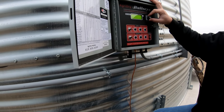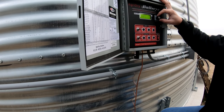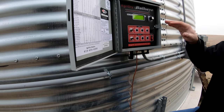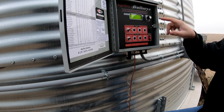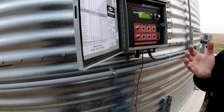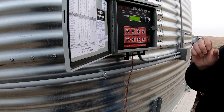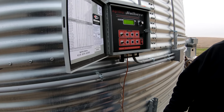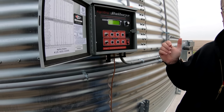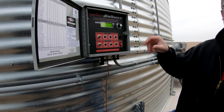You're pretty good on the cool — I would actually open that up to about a 1 to 1.5 right now, just because you're probably going to dump some more on top of this thing eventually. When it comes time, you narrow that back down. At 1.5, that's going to allow it to run clear down to 13.5 and all the way up to 17.5. You're shooting for an average, not an exact thing. The bigger that number is, the more the fan will run trying to get it cooled off.